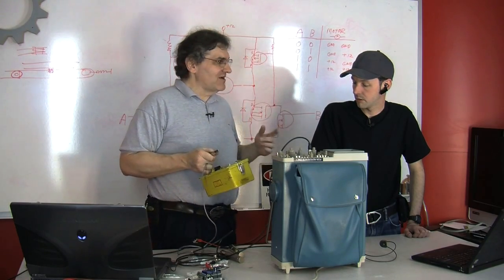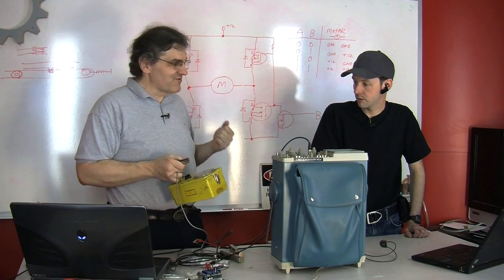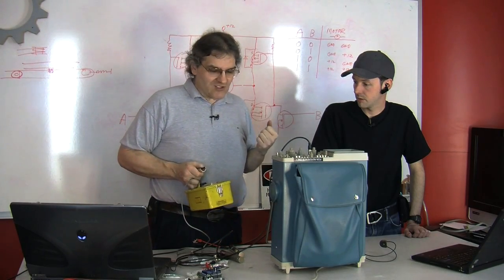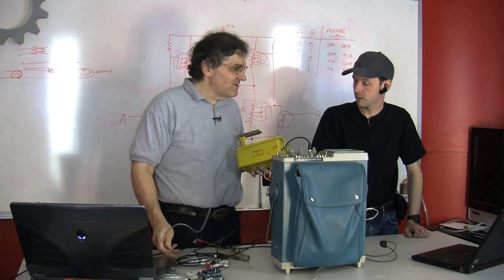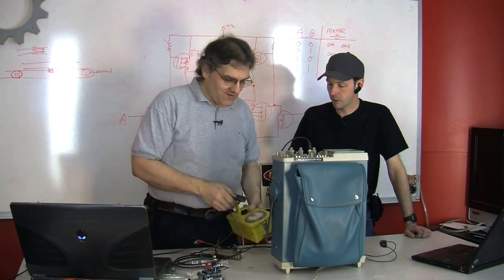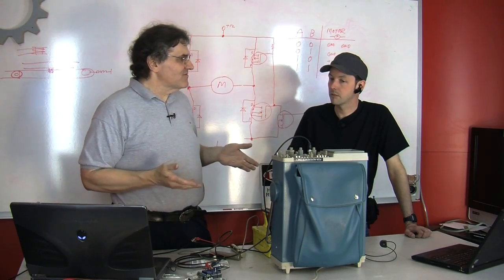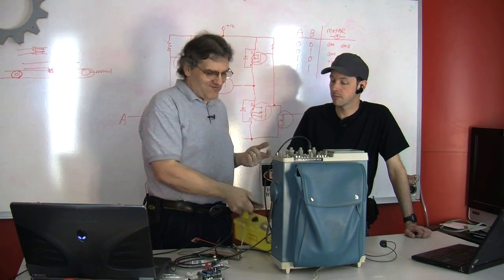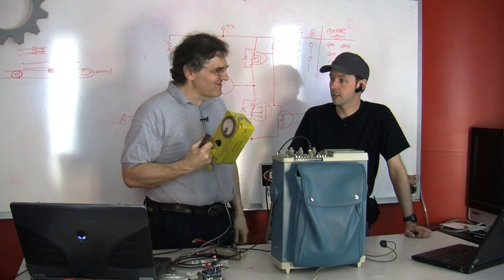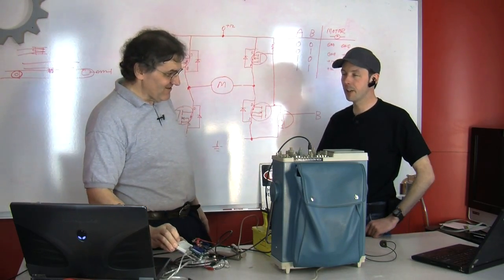Lots of people are trying to come up with ways of interfacing to them. I've seen a lot of circuits — most of them direct connect. I saw one guy on a website suggest using an opto-coupler to connect up to it, because you're outputting a negative voltage pulse — and for this one it was about 25 volts, which is kind of ferocious. We're going to use an Arduino for our little connection.